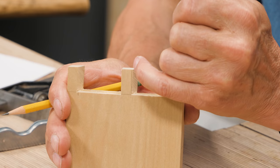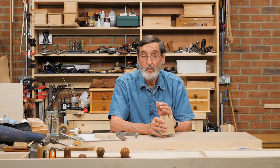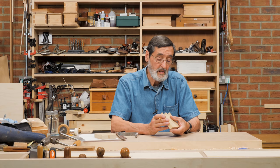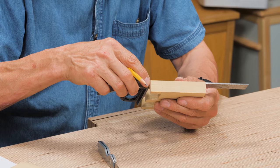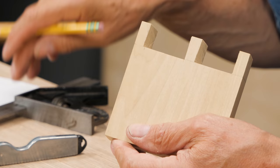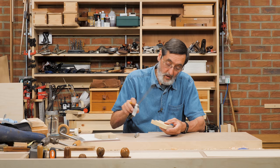I can see that this was out of square. I think this could be because you used a chisel to pair-cut the surface of the dovetail. I generally don't pair-cut my tails or my pins ever — I try to get them directly off the saw. Some schools will teach that you can do that, but it's not really correct. Most of the dovetails I've ever seen cut, especially looking at old methods, will be cut directly from the saw. I put a pencil line on there, I've got a gap — it's tight at the bottom — and that will show as a gap.